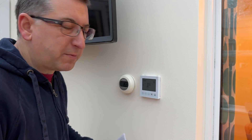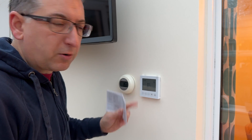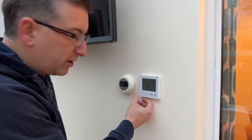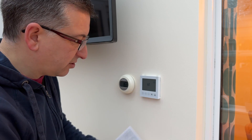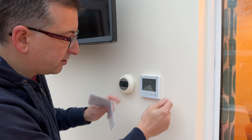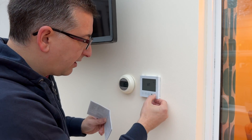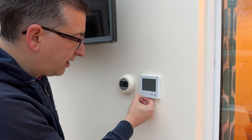Here's something that might be useful for you: if you want to use the underfloor temperature probe you actually have to configure it to use that — I had to read the manual to figure it out. You've got the option of using the built-in temperature sensor on the wall, the underfloor probe, or both of them together. What you do is power it off, hold down the OK button for three seconds, and it will show BN on the screen. At the moment I've got it set to N2, which is the underfloor temperature. N3 is both, and N1 is just the temperature sensor in the unit. I set it to N2, press OK, and turn it back on.